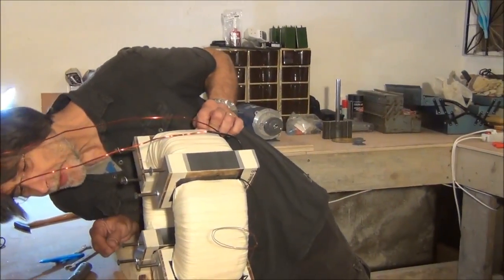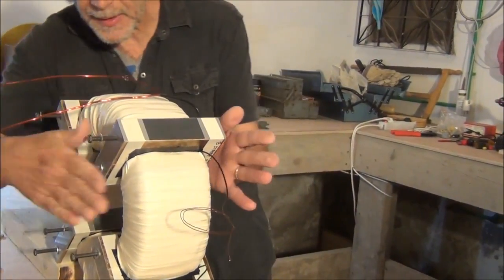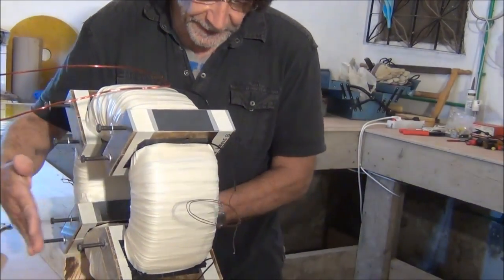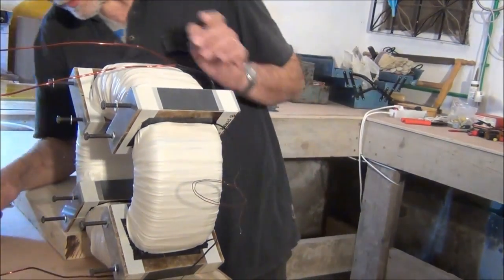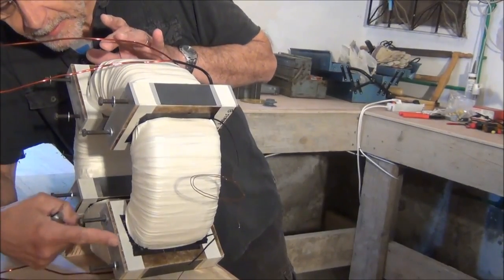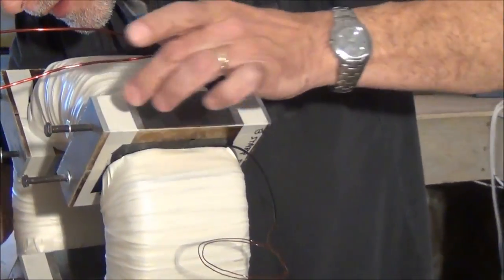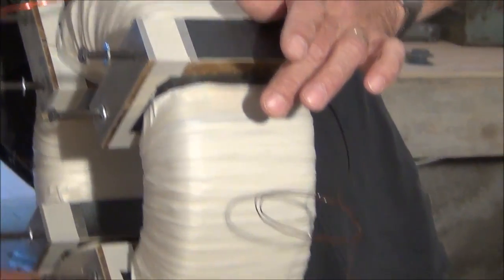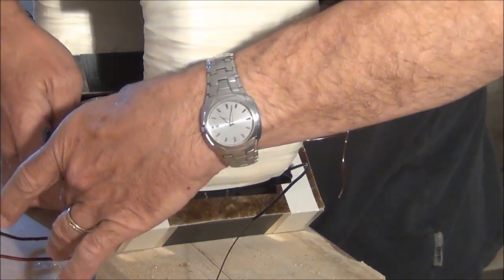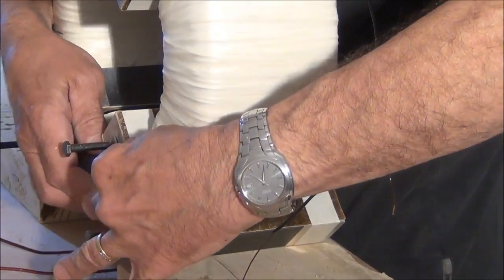What I'm doing now is trimming the mica plates that were sticking out a little bit — these eight surfaces have to be flush so that the end plates fit tightly up against the core. I've just been trimming to make sure the mica is not sticking out above the surface of the spacers. Then we'll use the core itself to lay out the hole pattern and drill holes in the end plates to mount the core onto them.